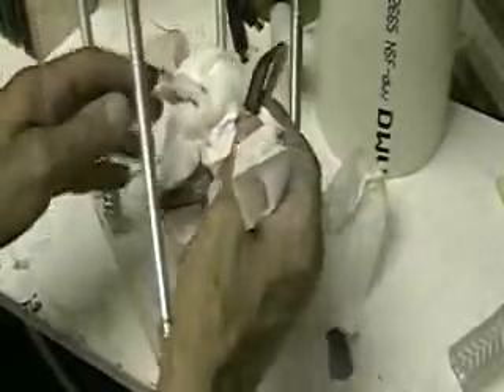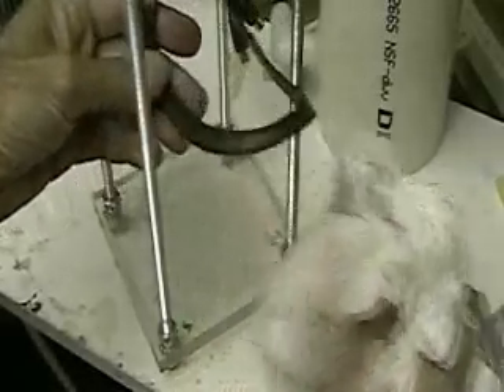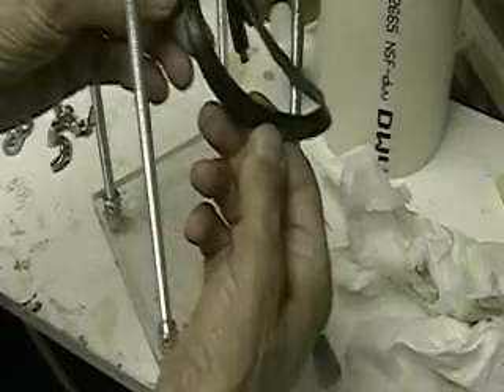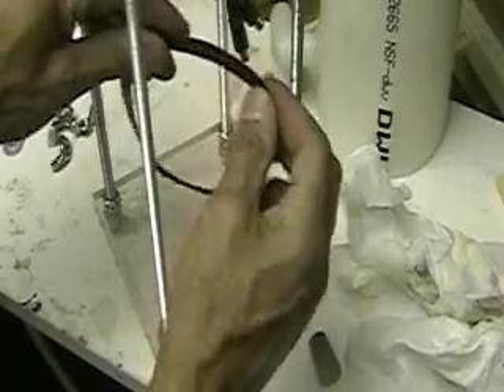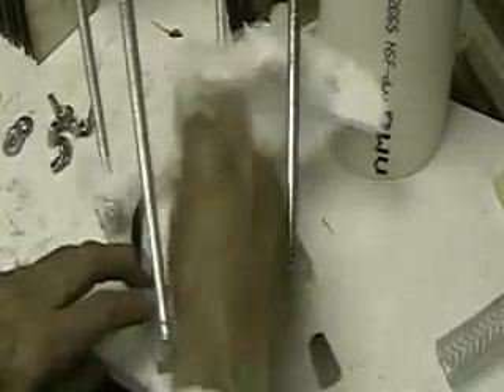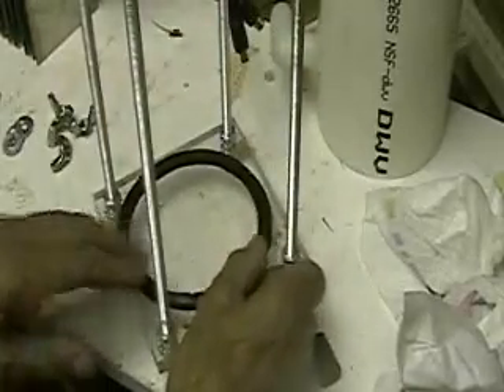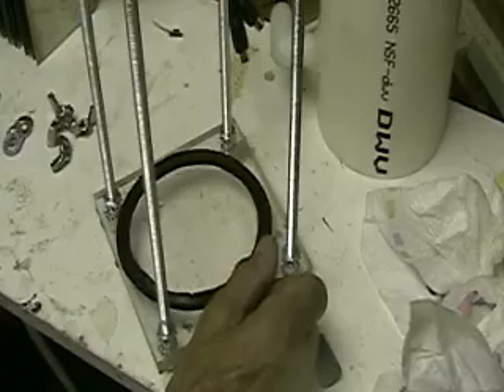You can see the seal on the bottom — it's really thin because it's waterlogged and I had to tighten it down. I'm either going to put two seals on the bottom or wet this one thoroughly before installing. The bottoms of these tubes are precision cut, so as long as it's down there tight, the seal should be good. But remember, if you put them in dry, as they get waterlogged, it will have to be tightened down.